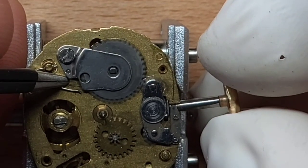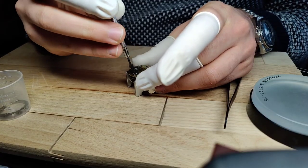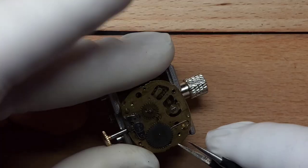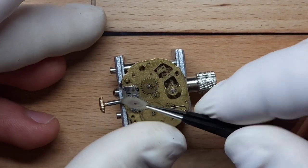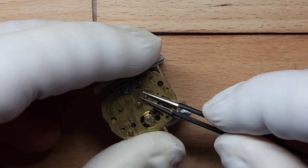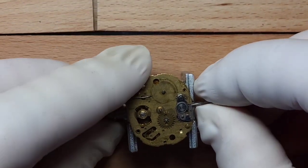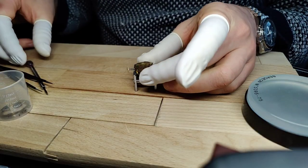Because the crown was stuck in with the winding stem, it was actually incredibly easy to let down the mainspring. Obviously this wasn't running, but it did have a full wind in it, so clearly something was gumming up the works. I'm rapidly accelerating through the disassembly of this watch, but to be perfectly honest there's not actually a whole lot to disassemble - there must be about 25 pieces in the entire thing. They're all lovely big brass-on-brass, metal on metal, just like you get on a pocket watch. If you're wanting the next stage into horology and watchmaking, this would do you well.